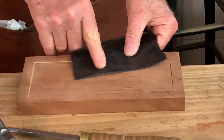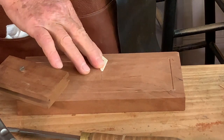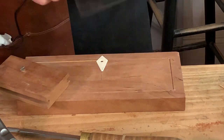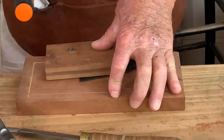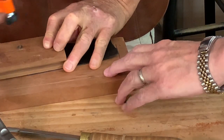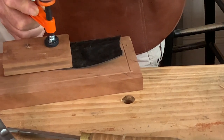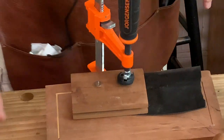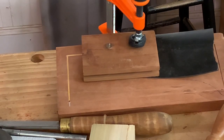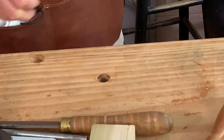And we need a piece of scrap wood to go over the top of it. Oh, I'll use this. If I was worried about the glue squeezing out, I'd put a little piece of either packing tape or wax paper on there to keep it from sticking to this. This rubber is not as important for that kind of inlay as it is for an eagle or a quarter fan like this. Rubber's more important for these things. This will work. So we'll let that dry a little while, and we now have a keyhole inlaid on our drawer.